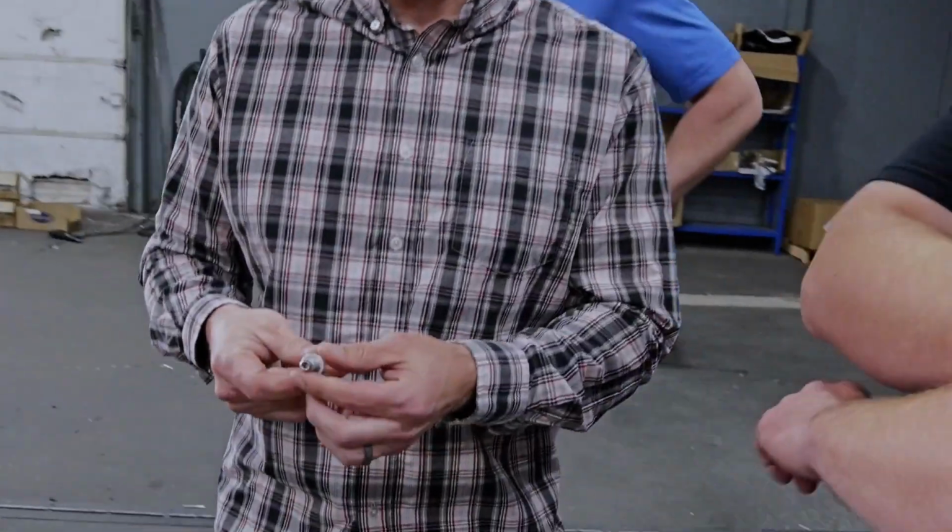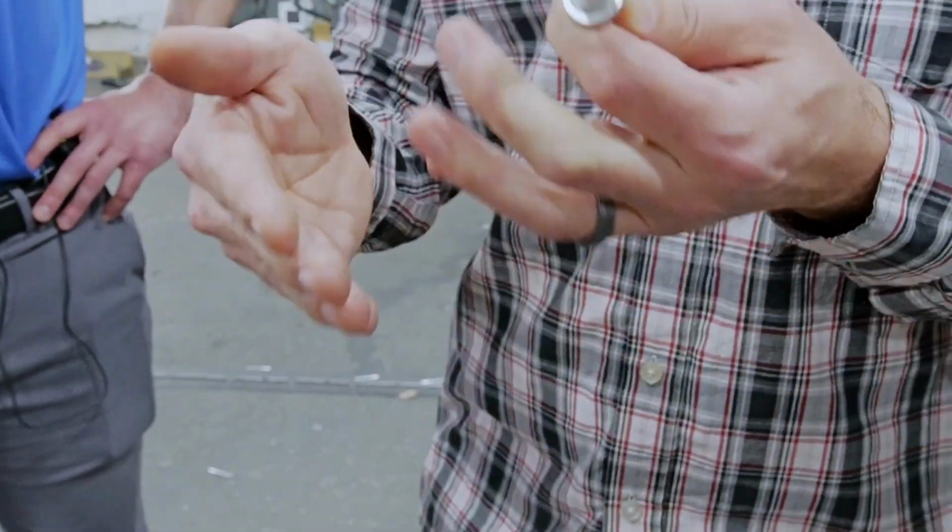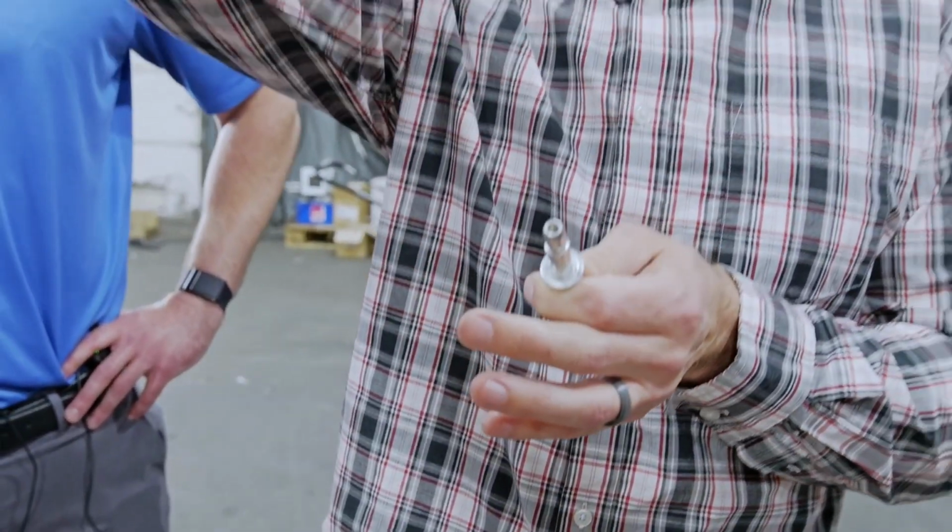So can you explain a little more in depth the way they fasten it, as opposed to welding? It's a strong rivet essentially. Just trying to understand the benefit of this versus a weld. Well, the tolerances are crazy, because now we're talking about machine tolerances fitting together as opposed to manually putting fixtures together on a giant frame to try and locate things. Our holes locate everything, so the tolerances are way tighter. You don't have any of the heat draw or the heat effects on aluminum that weaken it. Multiple benefits to it.